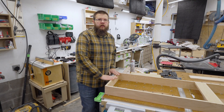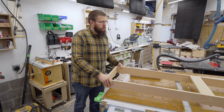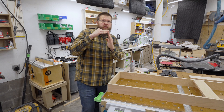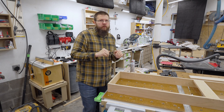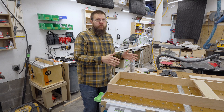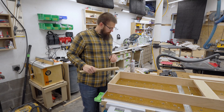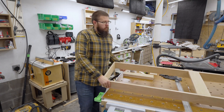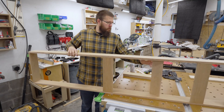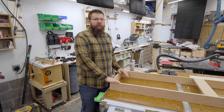So I want to briefly touch on how I do my cabinet bases. This is a one piece separate base and that's my recommendation. If you're going to build cabinets, don't notch out for the toe kick — don't do that. It makes it way more complicated to install, unless you're using cabinet levelers. If you want to save a bunch of money, do it this way. It offers many advantages. In this case, I have a three cabinet run that's under eight feet long, so it's just a one piece unit. This is the best way of doing it in my opinion, by far.